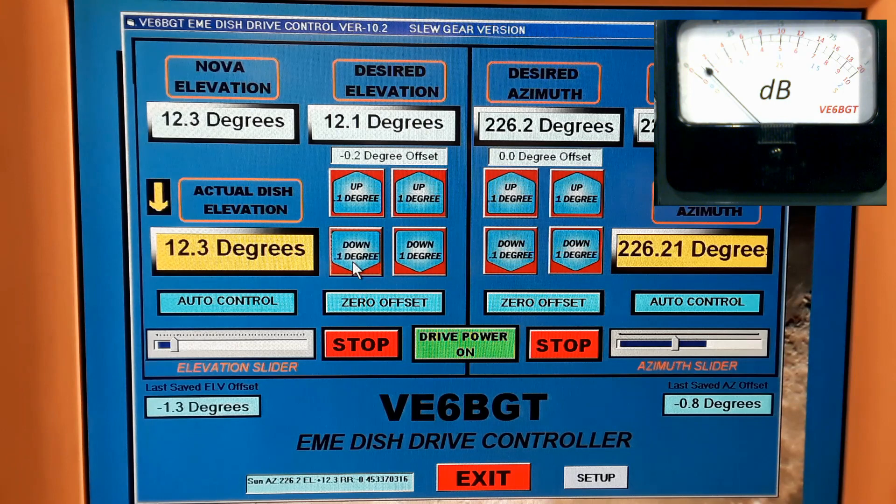As you can tell from the noise meter, we have no indication of solar noise whatsoever. So I start clicking the 0.1-degree increment buttons and you'll see the offset text window increase or decrease as we peak it to get a noise indication. The noise meter is switched to the 20 dB full-scale selection and we're going to peak up and down until we get a maximum. What this is actually doing is correcting for mechanical errors in my dish mount — mainly mechanical errors; nothing's perfect. The elevation is pretty well peaked; I'm going to tweak the azimuth drive a little bit.